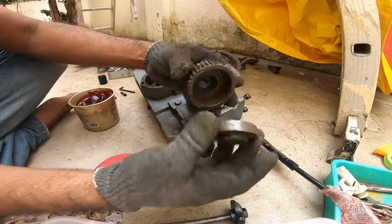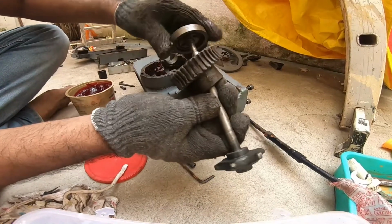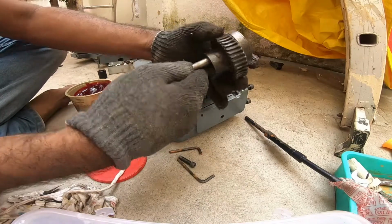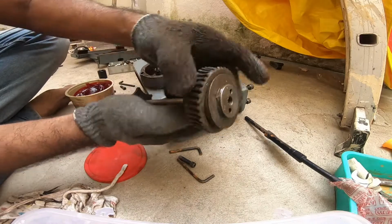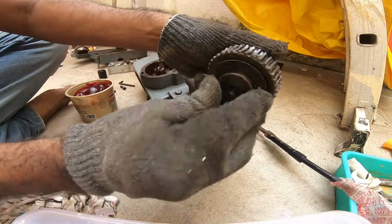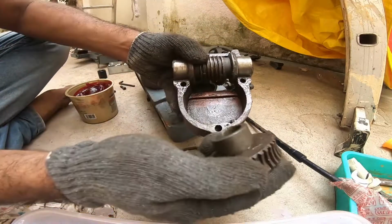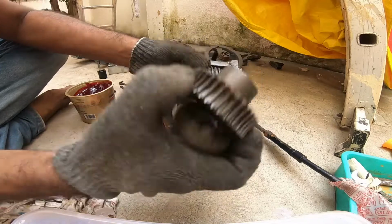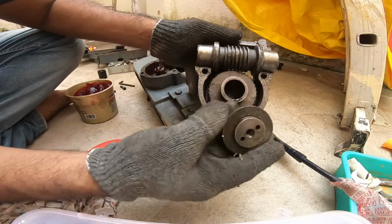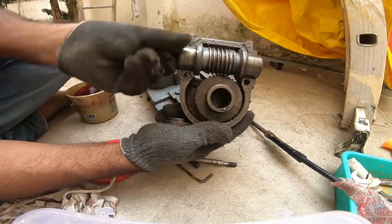So this is the clutch. So once we tighten this, this gets engaged with this pinion gear and the entire assembly tends to spin. So that is how the lathe carriage clutch works. So this goes to the... this is connected to the lead screw, and this is a clutch assembly, and this is a clutch. When the lead screw spins, this spins.